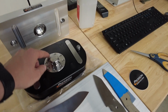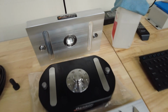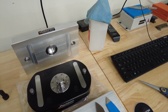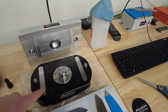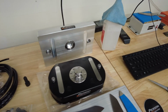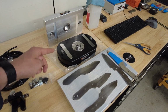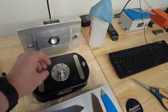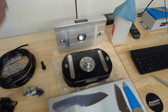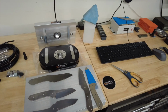These ball bearings are engaged in the bottom of the pallet, drawing it downward. These pins on the corners, they locate the pallet rotationally, and these surfaces are what it is held down onto. Now, when I engage this to basically trigger airflow to the pallet, the air pressure will actually release the tension on these balls, and I'll be able to lift the pallet off. So by simply hitting a button, I can switch pallets out.